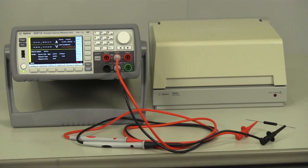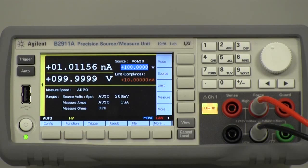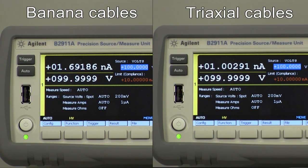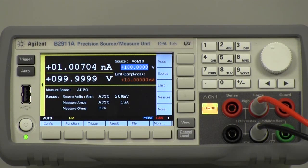As a trial, let's show you what happens if you don't use triaxial cable and a shield case. As you can see, the sample is unshielded and connected to the SMU with just banana cables. The measured value is 1 nanoamp as before, but you can see more noise on the measured current. The cable and sample itself are receiving environmental noise. I recommend you to choose equipment carefully when you perform low current measurement.